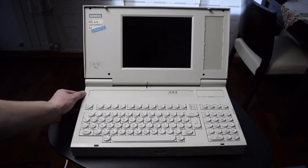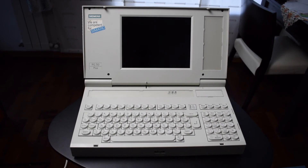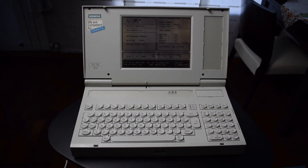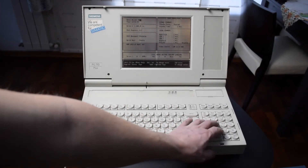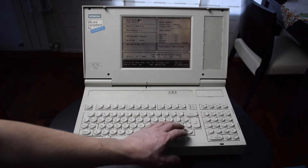I'm ready for a test and at first glance the monochrome LCD display has some shading because of its age. But no worries because there is a 15-pin VGA port on the back for an external monitor. That said you need to enable it first from the system BIOS by setting the default display type to CRT.